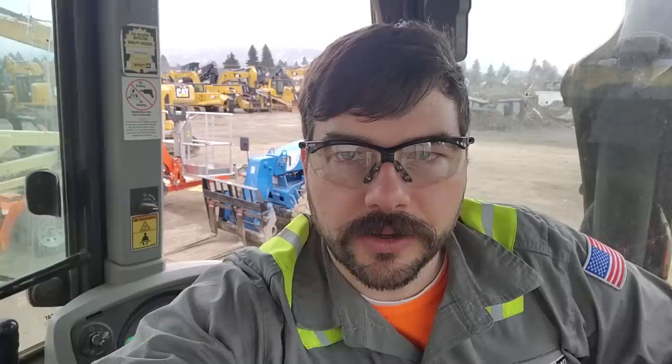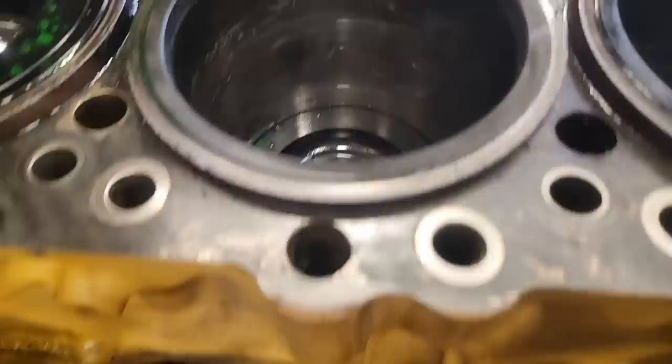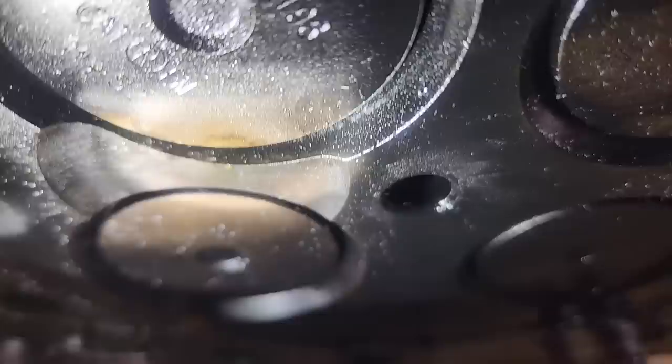I'm currently sitting in the backhoe I was working on Friday. That's all done, but I need to get back on Purple Pete and see what the heck's going on with the liner protrusion. You may notice behind me, we got a storm rolling in. This is Monday morning, and we left the engine Friday at this point. You can see the head's been removed. We've got this kind of a weird color film on top of the deck here — we'll be discussing that more later. But I cleaned up the head a little bit around the valves, and I did find that three, between the intake valves, is cracked.